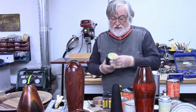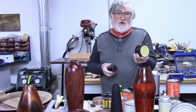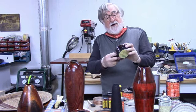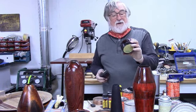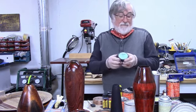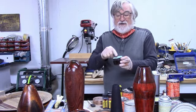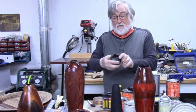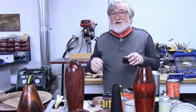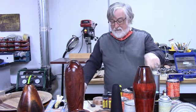The other one that I've been using is Axe. Almost exactly the same. This is a little thicker than the Yorkshire Grit. That's good and that's bad. They even give you the formula on the back. It's beeswax, mineral oil, and Tripoli. That's it. Okay, I can live with that. Or after you apply that and get it all wiped down, you can use the Axe Polish and Restoring Paste, which is basically wax. It's mineral oil, beeswax, and carnauba wax. Or you can get the components and make your own and do whatever you want. But they are very, very convenient.